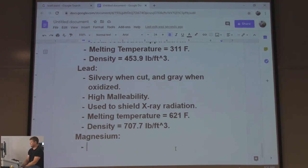And if you weld magnesium with an aluminum wire, you'll weld it, it'll be fine, and then all of a sudden it'll go. You'll look at it and the weld will be just loaded with little cracks. It looks like a piece of glass that's still intact, but somebody hit it with a hammer. I mean, it's just loaded.